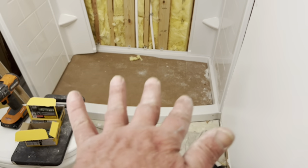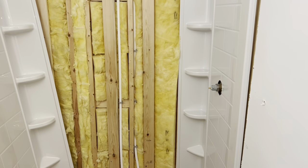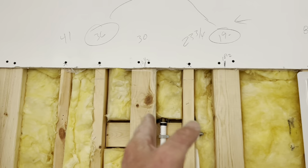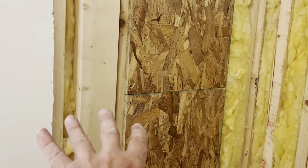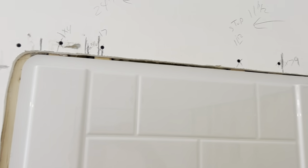I've installed the shower pan, mortared it in, did it by the book - she's beautiful, level, and squared up. My walls have all the stud work added - you need a stud every ten and a half inches. Behind here OSB boards have been added, and one-by-fours have been added to beef it up. I'm now dry fitting the panels as per the instructions - and always remember, read the instructions so you don't need to figure out how to fix the mess later.